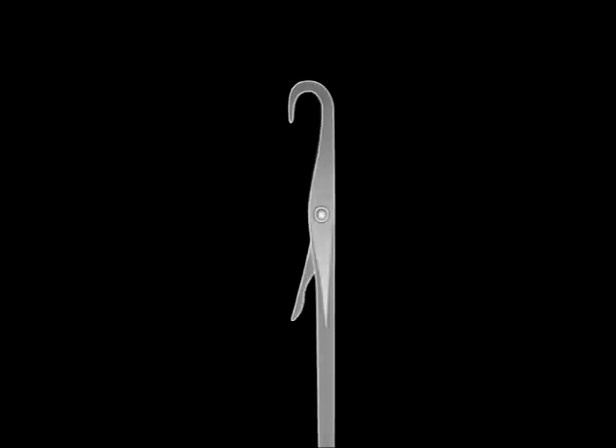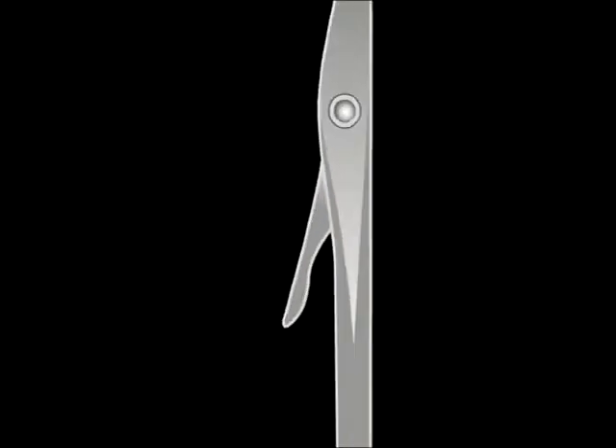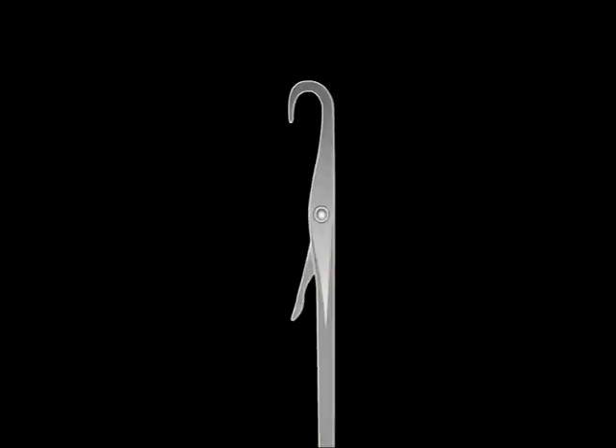Let's take a closer look at the needle itself and label its parts. At the top of each needle is a hook. Below this is a latch attached with a rivet. Notice that the bottom edge or cup of the latch is curved to fit over and completely close the hook. At the bottom of the needle is a butt, which plays a part in controlling how needles activate up or down. A needle with a latch is very efficient — when latch needles are used to create knit fabrics, the knitting cycle can be completed without any auxiliary attachments.